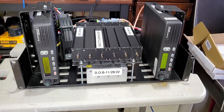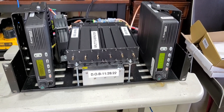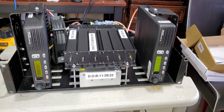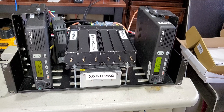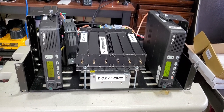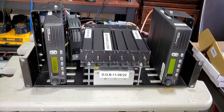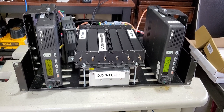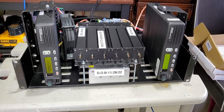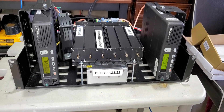As you can see, it has two Motorolas — the models are MCS 2000s. They're super reliable radios, which is why I chose them. They're 50 watts and I have them set to maximum continuous duty. You guys know there's no such thing as a truly continuous duty radio, but if you keep the system cooled it'll run forever. I already ran a test on this one — I ran it for two hours continuous and I only lost three watts out of the PA.